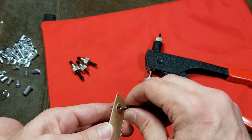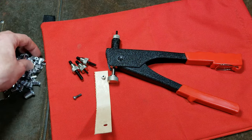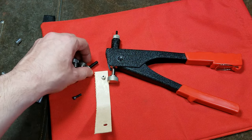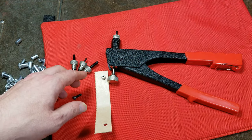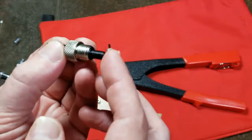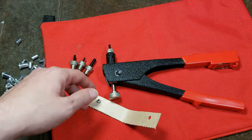This tool from Harbor Freight really seems like fine quality. It is Taiwanese, and it does come with a fair selection of threaded inserts. You can order metric size bits and threaded nose pieces for different tools online, but you'll want to be careful — sometimes the fractional counter-threads that hold it into the tool will also be fractional, and you end up having to buy two separate tools, one for metric and one for fractional.